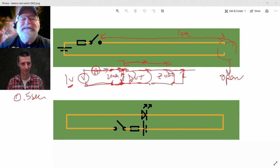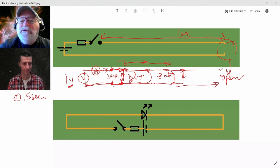And that's because the input impedance of this transmission line changes. If I initially connect my ohmmeter and I launch that 1 volt signal down that line, it takes 1 second to go down. What's it going to do when it hits the open? It's going to reflect, and now it's going to be a 1 volt going this way, a signal return. It's going to propagate in the other direction.